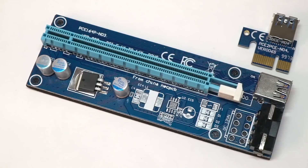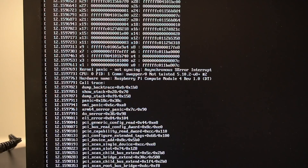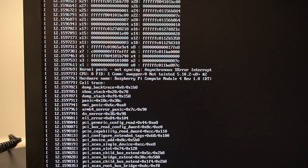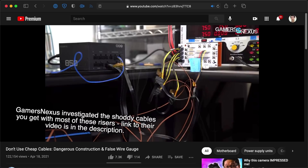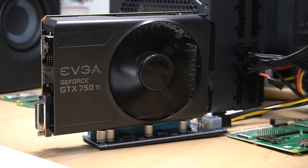First I tried one riser, and it resulted in a kernel panic before the Pi would even start booting — five different times with two power supplies. Then I tried another, which also resulted in kernel panic, so after three attempts I gave up on it. Finally, I tried a third riser: it kernel panicked with the USB 3 cable it came with, but if I swapped in the beefier USB 3 cable from the first board, it actually started booting. You have to be extremely careful with these risers — they don't use any kind of standard for the USB connections, so if you mix up the PCIe adapter, you could fry your card like I did with this ethernet adapter. So I ruled out power as the issue.